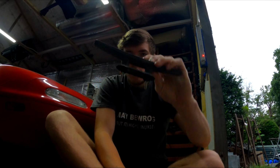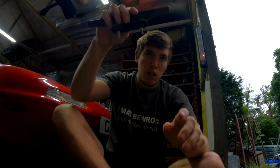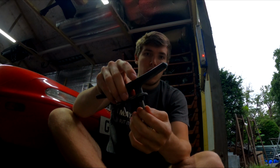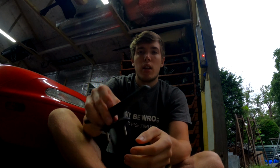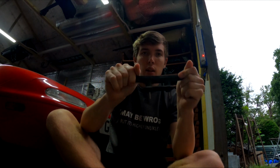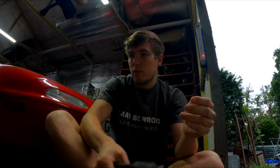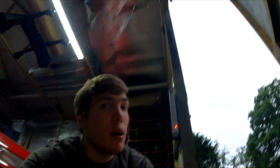So it's more butyl. We're ready to go, so we'll just stick that on. We've got our backing plate of fiberglass, and we've got the washers and nylock nuts. They go on the bottom, bolt it to the deck, and then we've got a nice solid cleat. That's how it's done, and I'll probably show you the end result because there is a lot of bolting to do, and I haven't got much time before the daylight runs out. So I'll let you know how it goes.